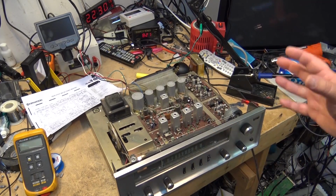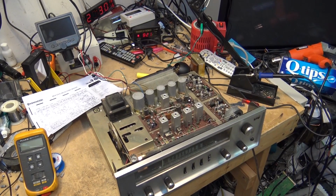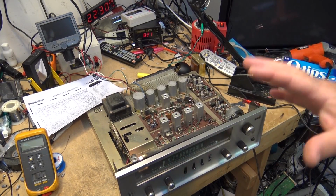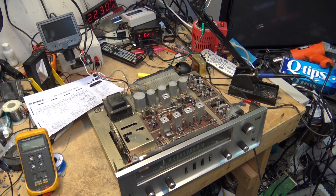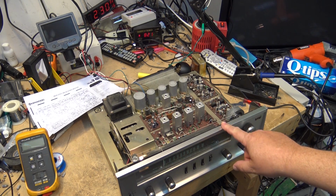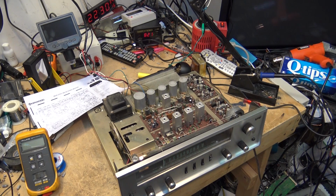Well, this is really maddening, okay? I changed all the capacitors on this thing, and I'm pulling my hair out. Why is this bloody thing not receiving stereo? I was listening to my test tone, and it sounded like the signals were mixed. I was just flipping through the stations. I thought, damn, the light comes on on peaks, but on quiet stuff it's not lighting up. This sounds like stereo. So I went and got some music that is in super stereo.